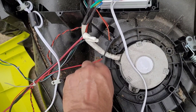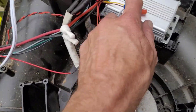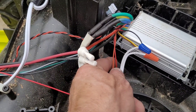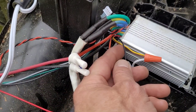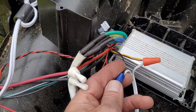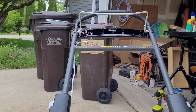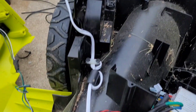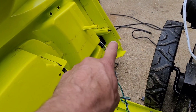The original wire came through here to a little attachment and goes into four wires into this little controller box. The red wire doesn't seem to do anything, so I just terminated that one. You connect the yellow and the brown to one side of your switch, and the black to the other side of your switch. I've routed this all the way up to one single switch.